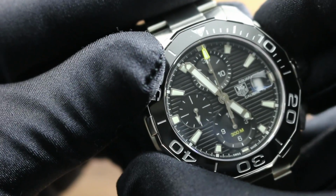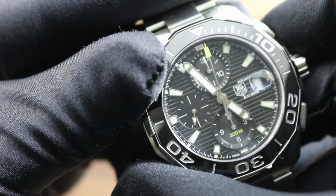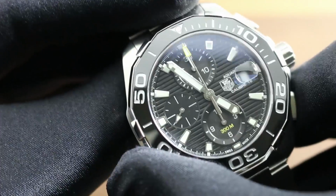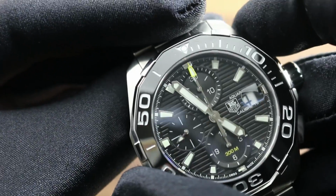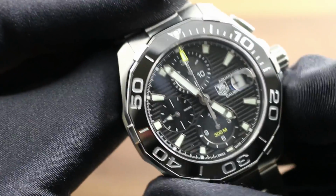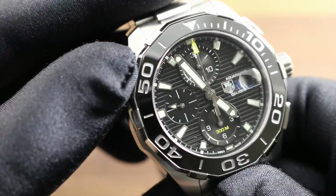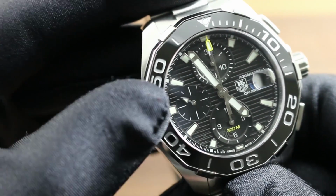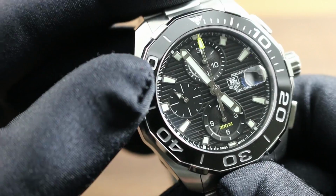The watch features a chronograph, which is started with the pusher at 2 o'clock, stopped with the pusher at 2 o'clock, and reset using the pusher at 4 o'clock. It's important to start, stop, and reset in all cases in precisely that order, as actuating the functions out of sequence, for instance starting and resetting, can damage the movement significantly.